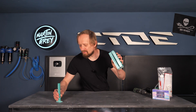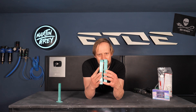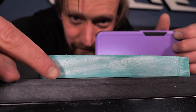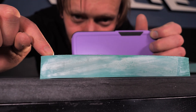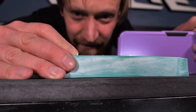Yeah, I have all parts for the mold but there are some issues as expected. The first issue is my registration points are too big due to my lack of 3D construction expertise, so I can't slip these two parts into each other — but I guess I can solve this with a drill. There is also another issue: check this out, can you see the light shining through the gap between the tabletop and the part itself? That's caused by warping. It warped at one of these edges, and in theory these parts should be dead flat on the table. Hopefully I can solve this with a bit of sanding.